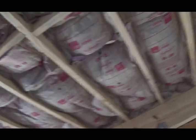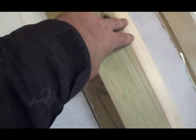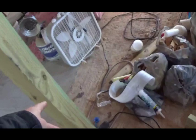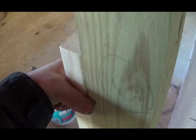So you can see here, the beams get built out. This one is being built out on this side plane. So instead of being a 4x4, it's a 2x4 kind of, you might call it a 4x8, but more like 4x7. This one will get a stud here where it's jogging out this way, and then a stud here where it's jogging out that way. So this one turns into pretty much a 6x6, once those are on there.